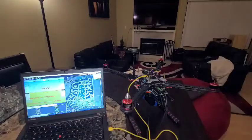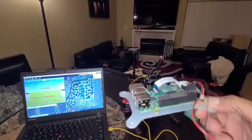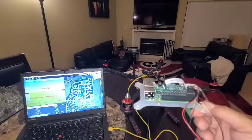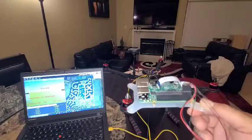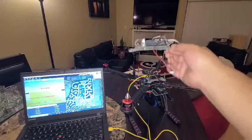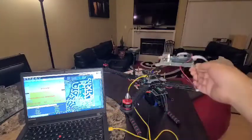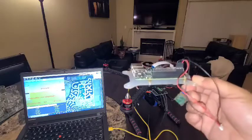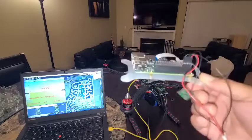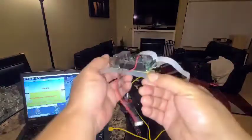So that's that. And then the other issue is this Raspberry Pi. Every time I put it on, it doesn't arm. I can't get the Pixhawk to arm, and I think it uses Bluetooth for maybe some other things here. So I'm going to change the port on this. There's a serial port on here, so I'm just going to go with a physical connection. See if I can get that to work, and then this is our flight computer where we'll fly it with code.